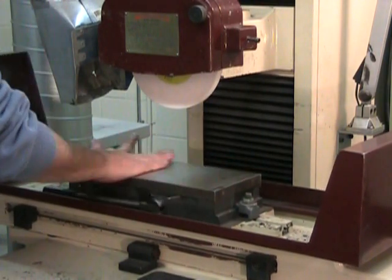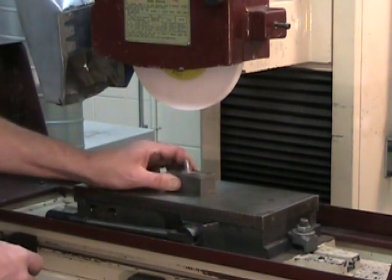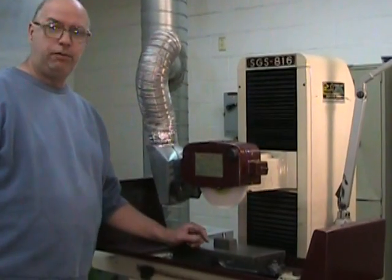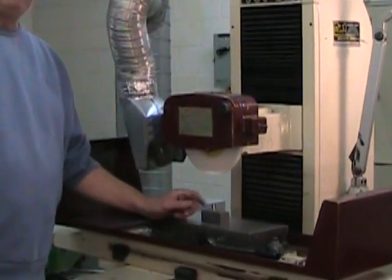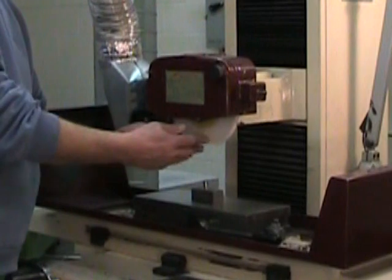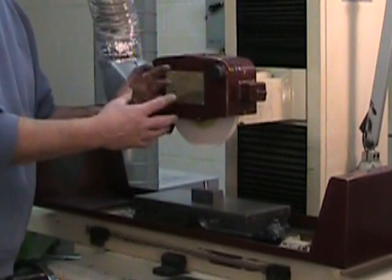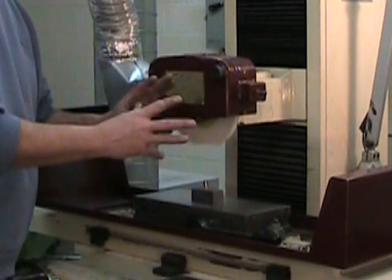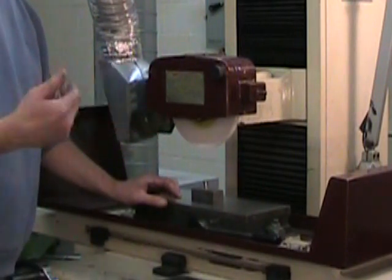I can now lock my table in the longitudinal axis and install my diamond dresser for the truing operation. The truing of a grinding wheel is a lot like dressing or surfacing a grinding wheel to sharpen it, but the objective is quite different. The objective of truing is to make the grinding wheel concentric. We've just installed a new grinding wheel and the hole on that wheel is a little loose on the mounting flange, meaning the wheel will be a little eccentric on the spindle. Truing will give us a nice round and concentric grinding wheel before we move on to balancing.